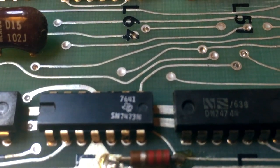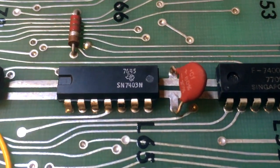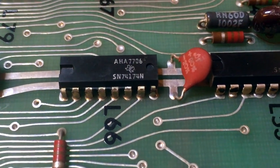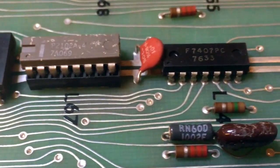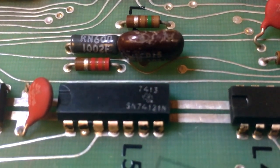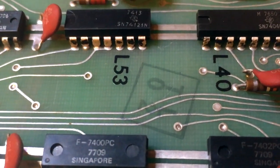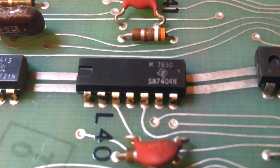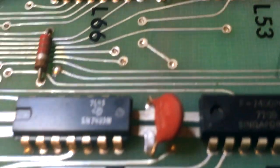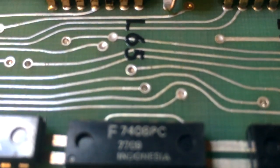The good news is that there isn't much pin corrosion, so I don't need to pull any chip just to treat that. Looking at the date codes of the different ICs, most of them are '74, there are a couple '73, one '76, a few '77. So I think this is a '77 or '78 machine. There is one big pass transistor dated '79 but it has signs of rework, so the '79 components have probably been serviced and this is a '77 or '78 machine.